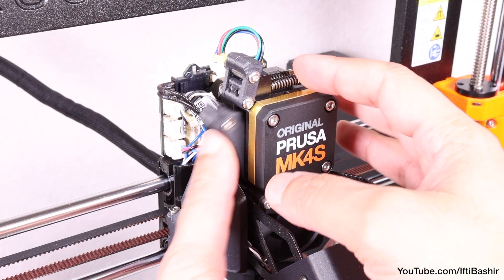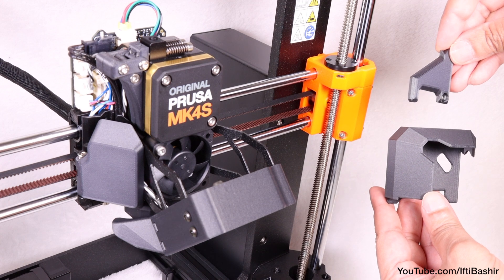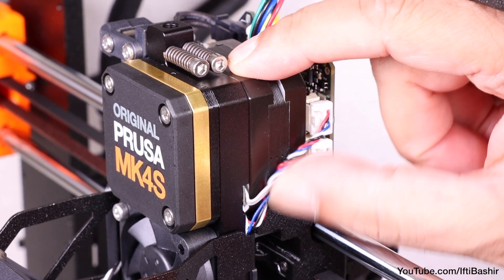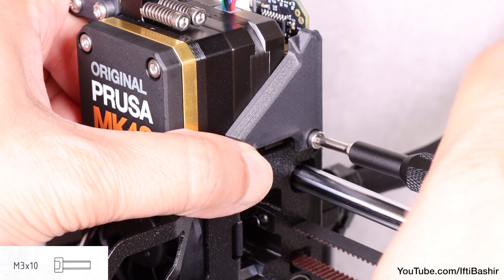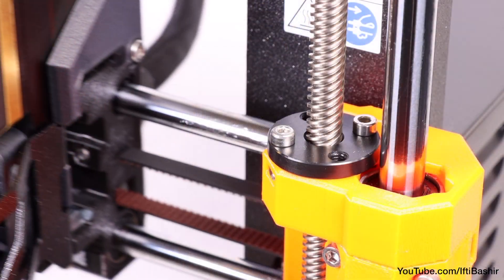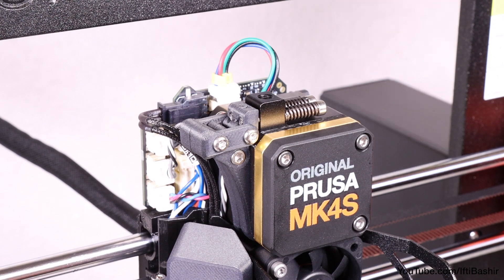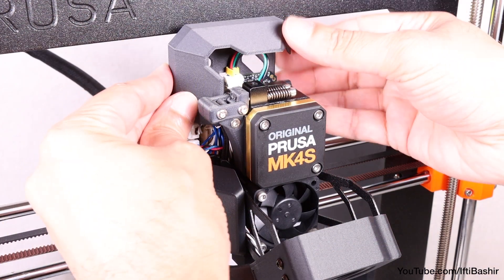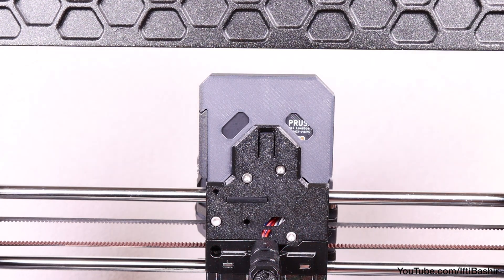Close the side idler mechanism before proceeding. Take the 3D printed LoveBoard cover and the side plate to finish the extruder. Starting with the side plate, curve and arrange the cable on the right side of the extruder in a clockwise direction, then cover with the plate and secure with a single M3 by 10 screw — taking care not to pinch any cables. This must be snug so the carriage can move all the way right without hitting the side, which can cause calibration errors. Push all cables inwards towards the extruder, then slide the LoveBoard cover all the way down, ensuring the two plastic covers meet perfectly without pinching any cables.